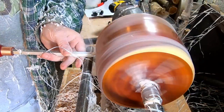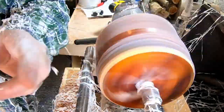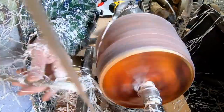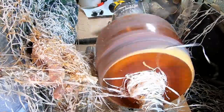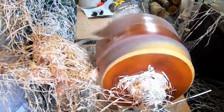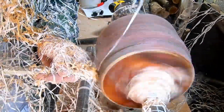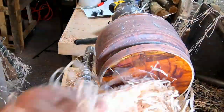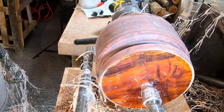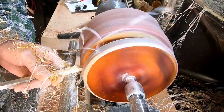As with my previous resin projects, I used the Easy Wood Tools mid-sized carbide finisher. The resin in this casting turned like a dream — the cutter was able to peel away streams of resin with very little shattering or chipping. I had said in a previous video that I needed to use a glove to protect my left hand from flying shards of resin, but not this time. I slowly nibbled away at the resin, exposing the yew blank in the base.